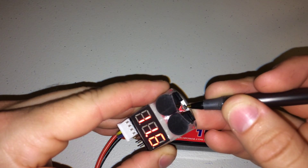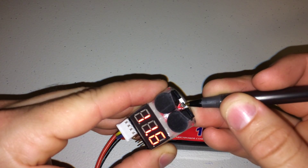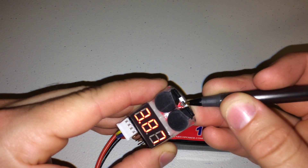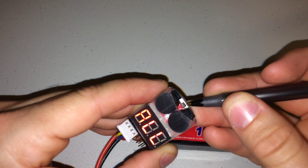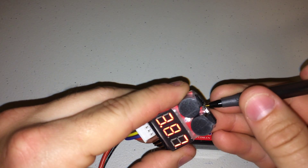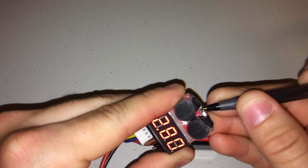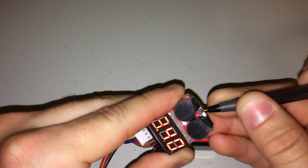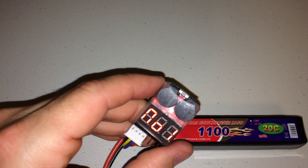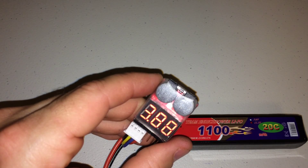The nominal voltage minimum that it will allow you to set to is 2.7 volts. You can turn it off, but I wouldn't suggest it — I'd set it to something so you know where you want your nominal voltage to be, either at 3.8 storage voltage or you can have it closer to 3. Right now it's set to 2.7, so just to change it you just keep clicking: 2.8, 2.9, and so on. We'll leave it at 3.4 volts. So obviously it won't go off because each cell is reading at 3.87 volts or maybe a little less or higher.